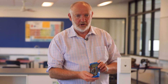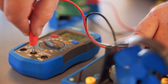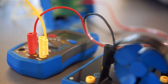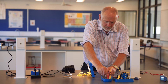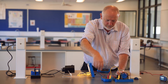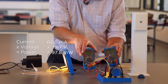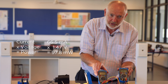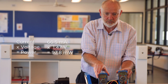Now if we want to measure the power that we're generating to go through that motor, we'll need to bring in another meter to measure the current. I'll take out one side, put it into the common, take another wire from the meter, and connect it across to the motor — that's measuring current, so I'm going to put that around to 200 milliamps. We're now getting 1.47 volts and 66 milliamps. If we multiply those together, we'll get how much power we've got in milliwatts.